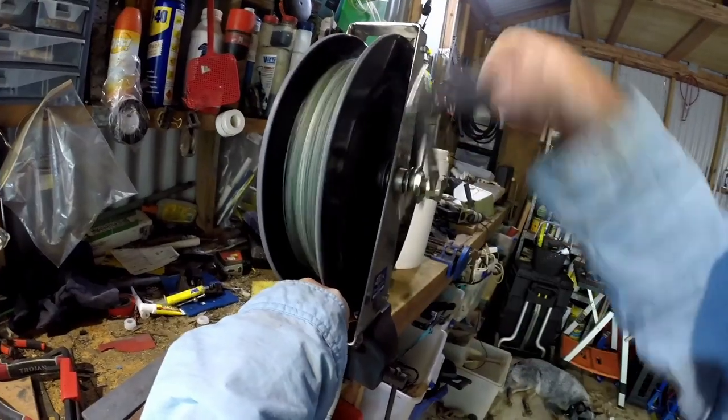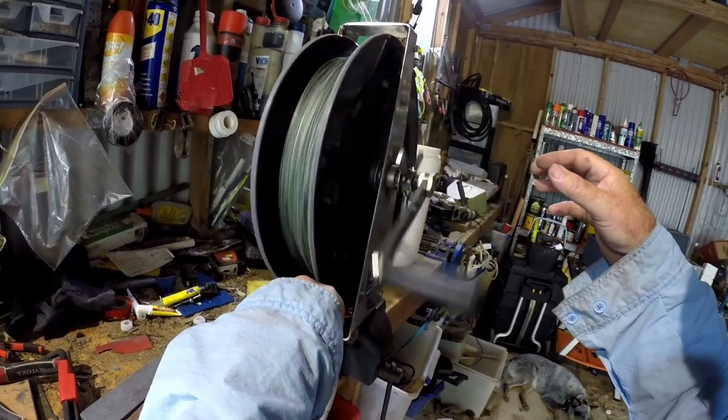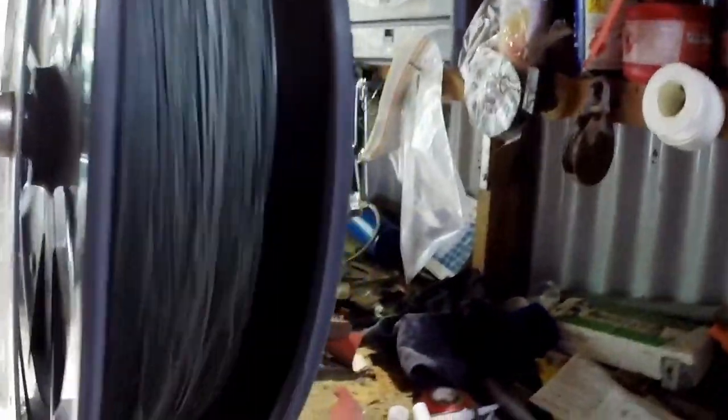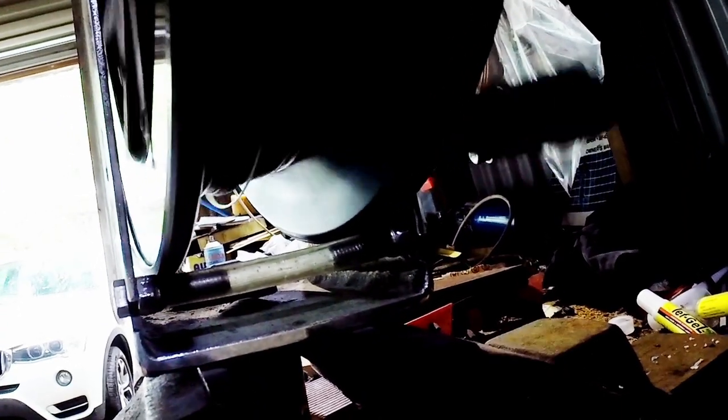It's really a simple matter of rotating it. This was really horribly out of whack — probably up to two millimeters — and patiently and slowly I've ground that down. Now it doesn't sound so good. About now we can see that it's still maybe out by about half a millimeter. Probably needs a bit more fine tuning until I get it flush.